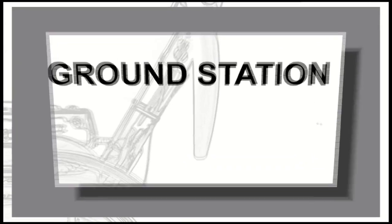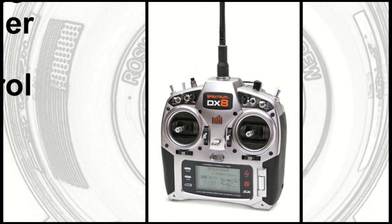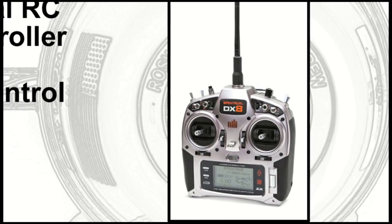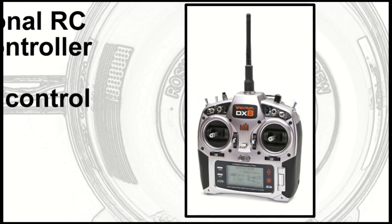We'll just move on to the ground station. This is everything you have to have on the ground while it's in the air. Generally, you look like the Borg. You've got so much coax cable going back and forth, but basically you need a control transmitter and a video receiver. The transmitter controls the aircraft: the right stick handles pitch and roll, and the left stick is yaw and throttle. With the multirotor, you just throttle up to go up and then pitch forward to move forward, and that's it. It flies like an airplane once you're in forward motion, unlike a helicopter, which gets a little wobbly in fast forward motion.